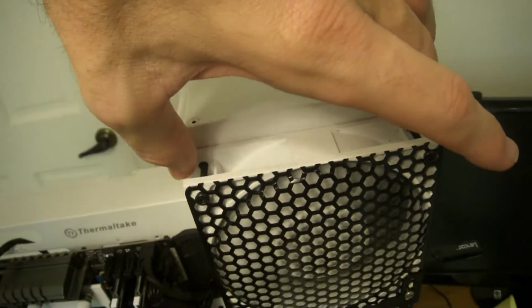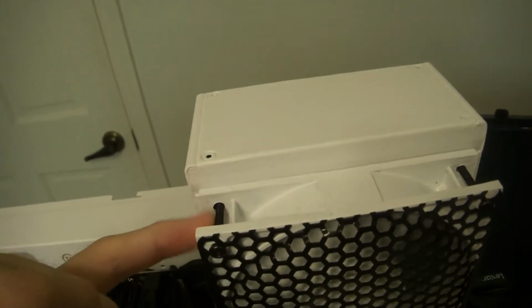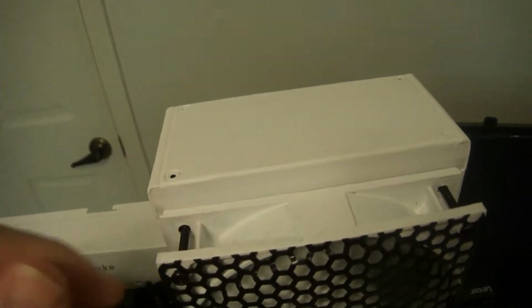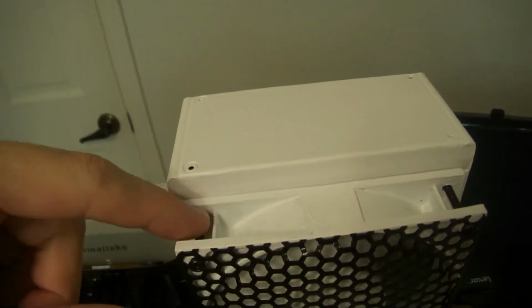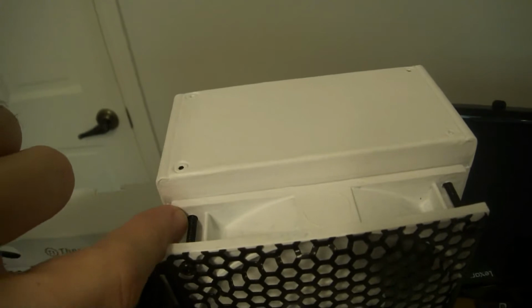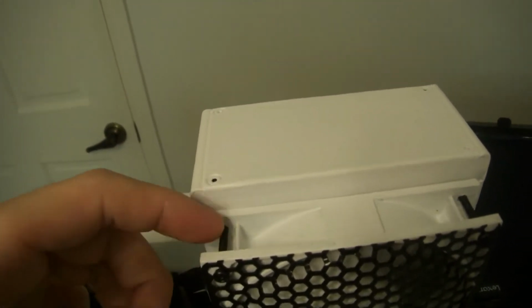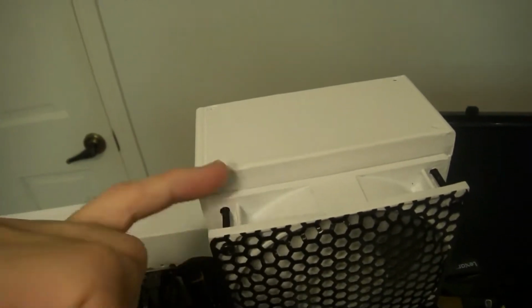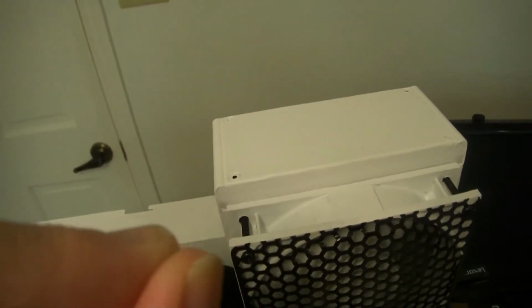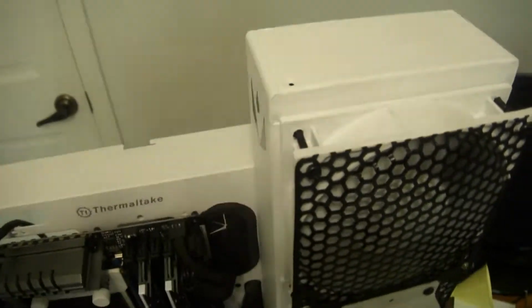Normally you have some leeway and it's much easier to line them up. If you paint sloppily, like I did with sloppy paintbrushes, dipping it in the can and starting to paint, you're going to get paint down in here, and that dramatically affected it. To the eye, nothing looked bad, and I checked everything as I was going. If it was covered up, I actually put a spare screw through it to clear out that volume of paint, and then got it drying as quickly as possible thereafter. That was not good enough.